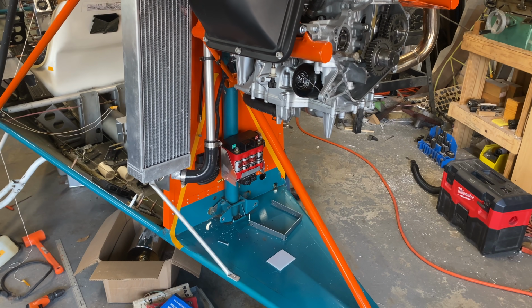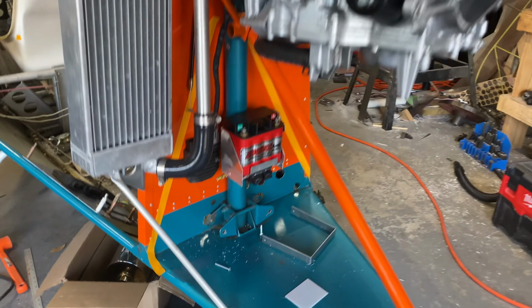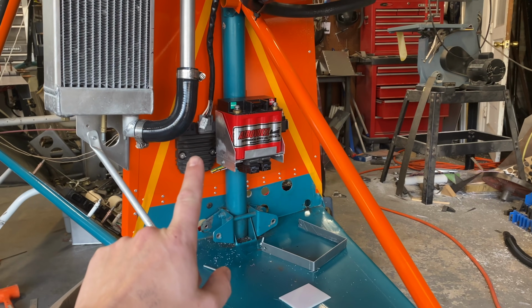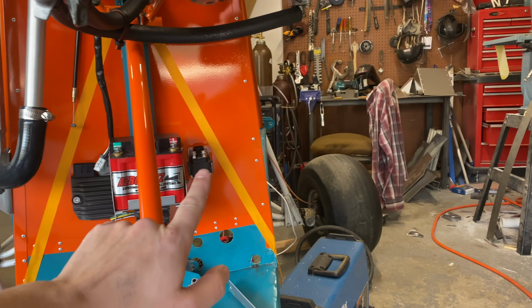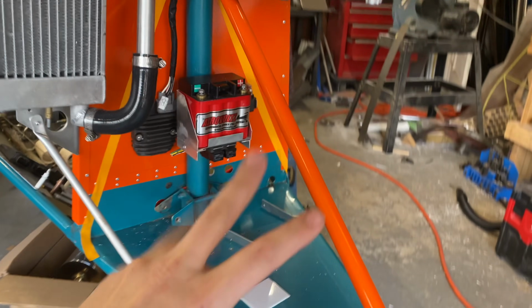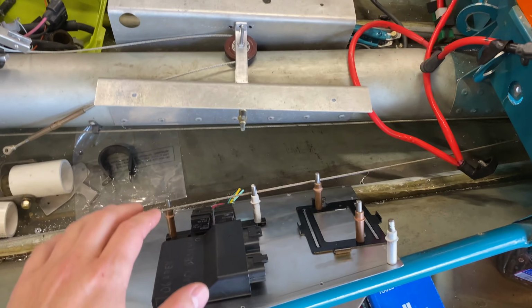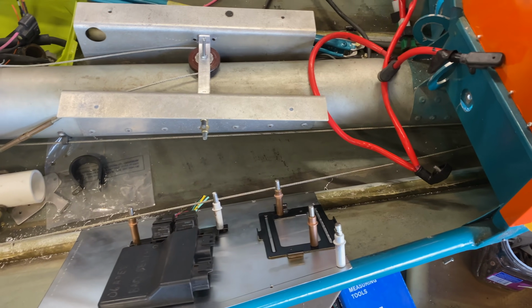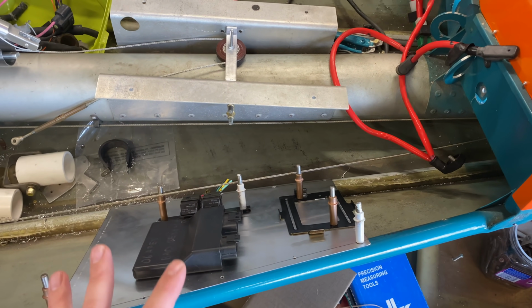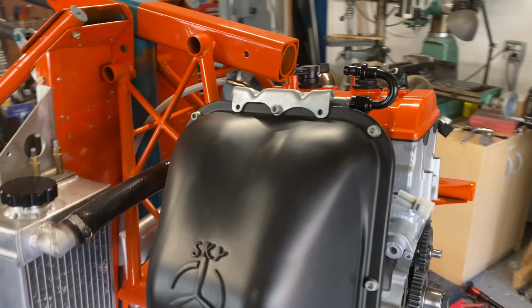Last time I was working on things, I got my firewall stuff pretty well taken care of. We've got our battery here, we've got our voltage regulator, our rear relays over here, our start solenoid, all good. We also got our other big systems, our ECU bracket, the remainder of our relays. This guy actually is the ECU, but I can't put him here with the clecos. That's all done. So that leaves us on to our next piece of prep for wiring, and that's sensors.